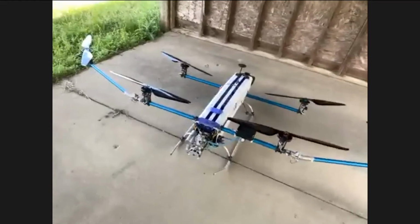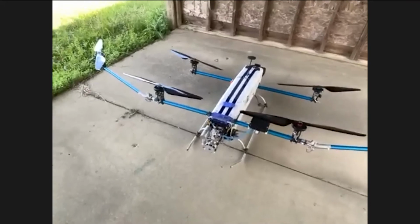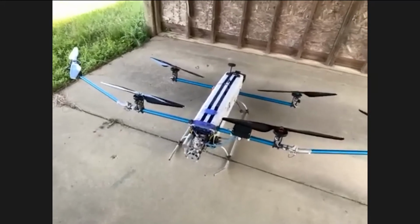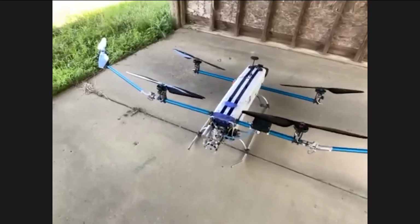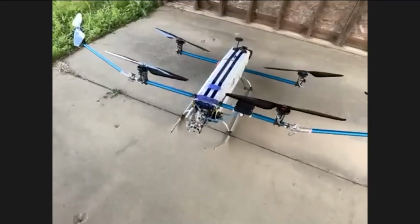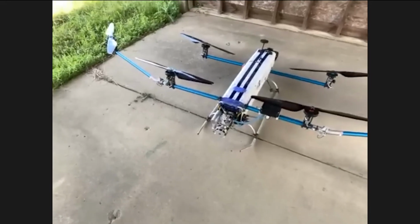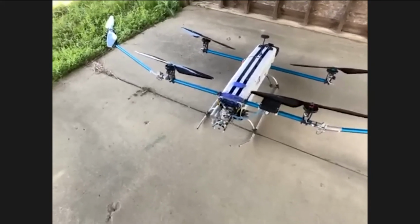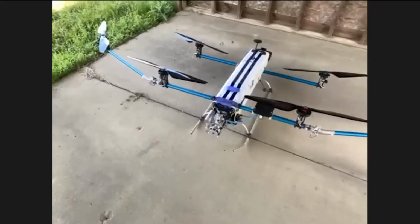Say you have a problem with one of the line replaceable units, or LRUs; all the complicated things are in a line replaceable unit. Call us up, tell us what the problem is, and we'll say that's a problem within this LRU. We will FedEx overnight a replacement LRU to you. The box shows up in the morning. The longest LRU to swap out is the engine generator unit, which can be done in less than 20 minutes. All the other LRUs are even quicker to swap out. Then your aircraft is back up in the air, generating revenue for you again before lunchtime the very next day. Contrast that with 2 to 3 months with DJI.